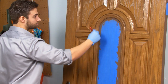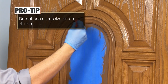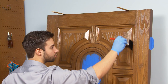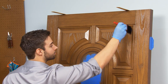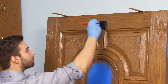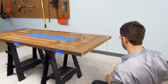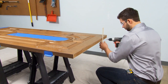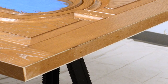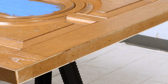It is extremely important to apply top coat in a smooth and even motion. Excessive brush strokes will cause the top coat to bubble or loosen the stain. Should this happen, wait about 30 minutes until the top coat is dry. Gently wipe away any flawed top coat with a dry cleaning rag. Then touch up with a thin layer of fresh top coat. After the door is completely dry, remove the two scrap wood pieces from the top. Then carefully finish the top edge by applying a layer of top coat, or if desired, apply both stain and top coat following the previously prescribed instructions.